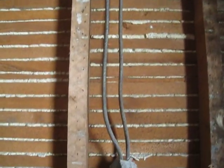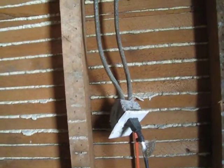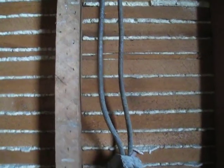There are individual conductors — hot and grounded — going to a receptacle, but notice there's no ground wire. So there's no fault current path.